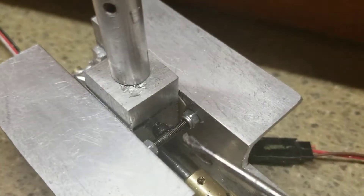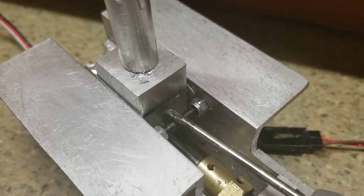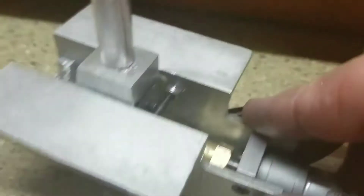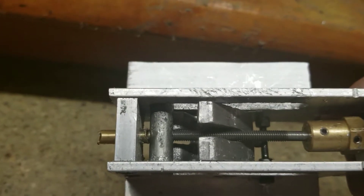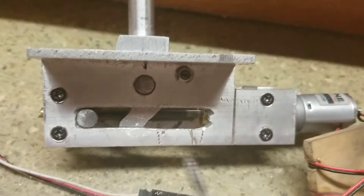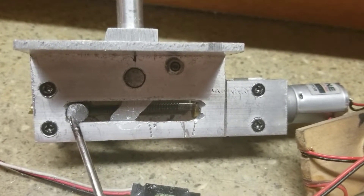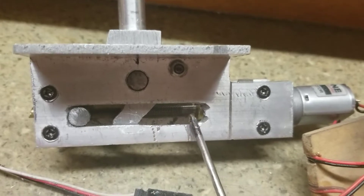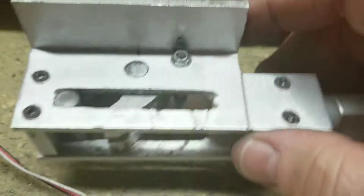You can see that hitting — these could be moved around to different locations. This could actually be moved a little closer to the truing block, and then this little thing would only be sticking out slightly. Anyway, it takes up the slack so it's really fully contacting the foot on the truing block. You can see in there — it's actually moving too far. The slot here is about a quarter inch longer than it needs to be. This action could stop about right here, and at the other end about right here. Right now it's two inches long but it could be one and three quarters.